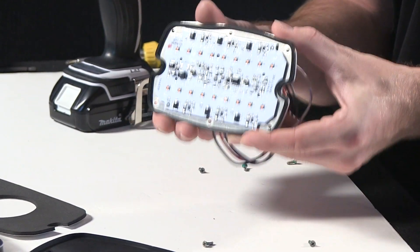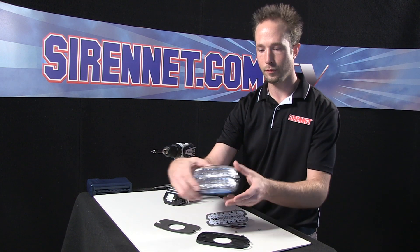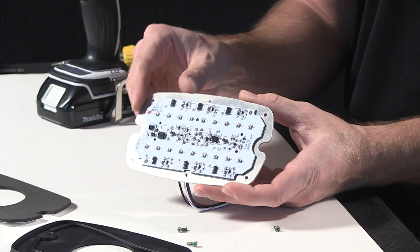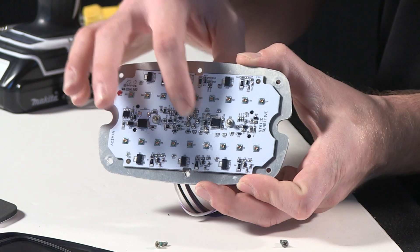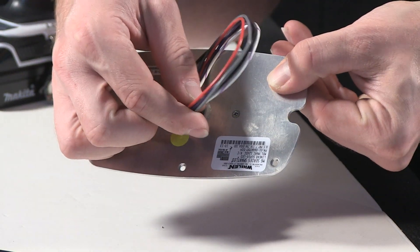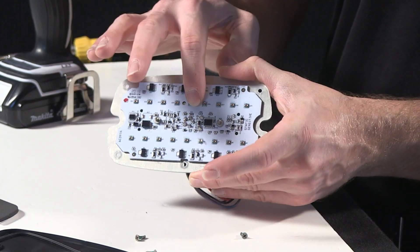This is really what is making your M6 LED head work for you. It has a perimeter base gasket molded to the classic shape of the M-series light head. You can see a series of diodes — a bottom row and a top row — looking to be 10 and 10, for a grand total of 20 diodes in this M6 light head. In the center, the wiring is soldered into the board. The pigtails are inserted separately on the assembly line, put to the board, soldered on, and now your harness is basically one piece with your front operating board.